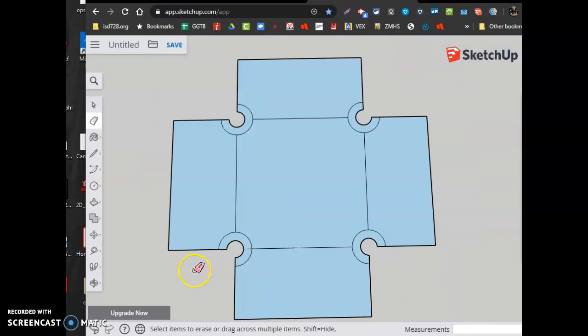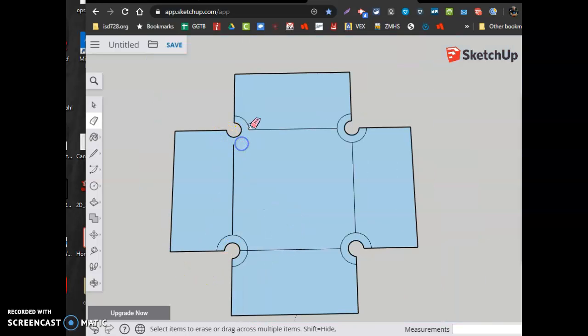flat, flat. Now I get rid of this piece and those pieces, and what I have is I have my box pretty much ready to cut and fold. So what I have here now is, oops, line came back. This is going to be a little folding line. I got a chunk of metal here still attached, so it'll still fold. Chunk of metal attached, folding line, all four sides. These are going to kind of help the corners to fold and not get pinched. If you didn't have that cutaway there, the metal will kind of bunch up. It'd be hard to fold and have this done.